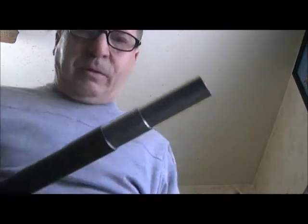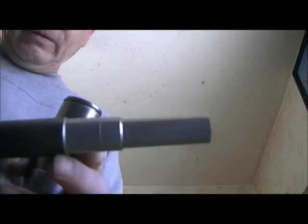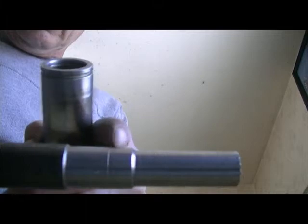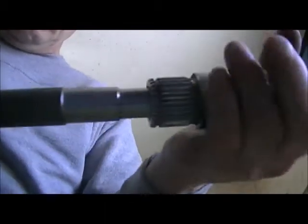Okay, so you're wondering what this is all about, shaft and everything here. This is the shaft that we just made. This is just a void here. It does nothing. It just has to be there for the length. We're going to press this in here, like so. There's a spline inside. And then right out on the outer end here is where this part of the shaft will get pressed. That's where our 4 thousandths is. There's a 2 thousandths crush there.